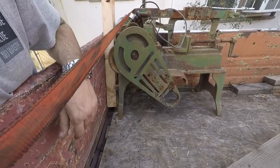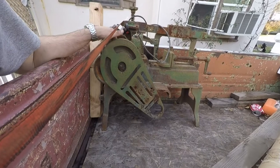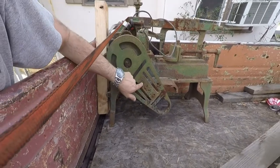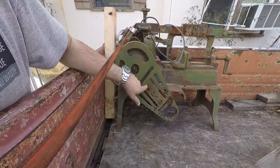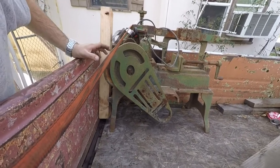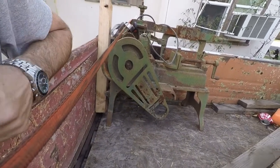I'm not sure how that got busted out of there, but it broke out nice and clean. I wish I had that piece so we could just put it back in. I could always take this off, doctor in a piece, and use this as a pattern to cast a new one — these are the only critical dimensions and we'd just cast it solid and drill out new holes. That's a little more expensive but you'd probably get a better-looking result.